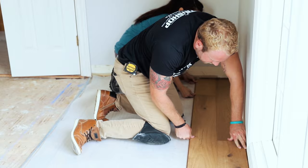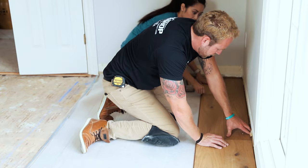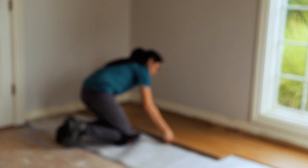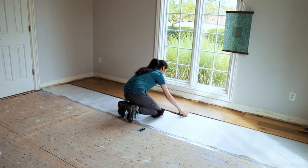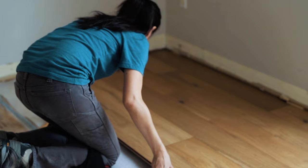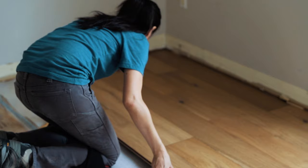It will save you a lot of time, grief, and heartache in the long run. We decided to pick the longest exterior wall in the home, which gave us a long straight clear benchmark to start from. Typically when laying floors in a single room you'd measure to make sure your first and last planks are similar in width — you don't want your first plank at full width and your last plank super skinny. Because we installed this flooring across our entire first floor, it was next to impossible to ensure every first and last plank in every room would be the same width, so we skipped that step and started laying the planks as is, knowing we might have to adjust along the way. It still turned out incredible.